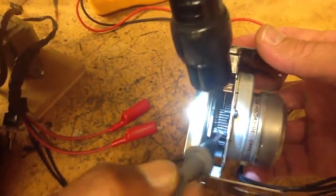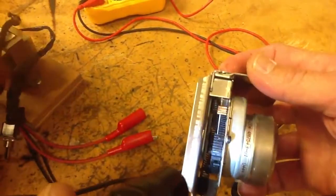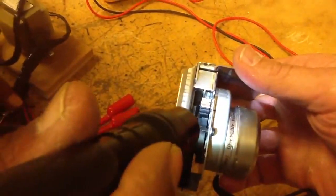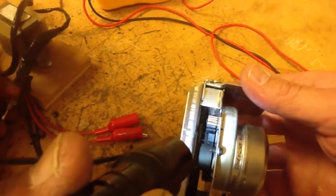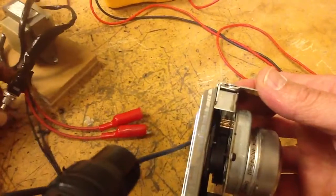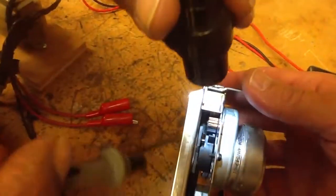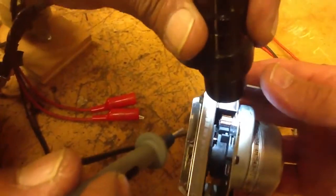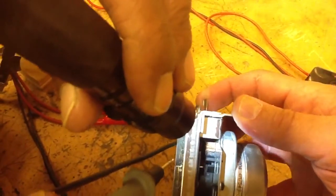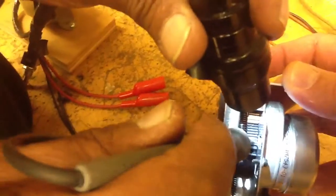It has no traction. Once it's open, water flows until the thermostat is satisfied, and when it's satisfied it closes back up. That gear is sitting exactly where the threads are missing, so the motor just spins. When the thermostat calls for cooling again, it does the same thing — just spins around. There's no traction until we help it along, and right there are the missing threads.